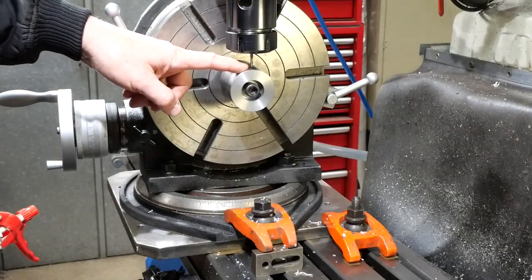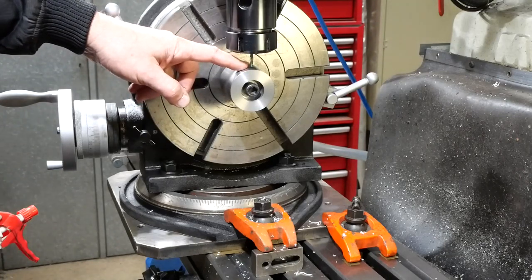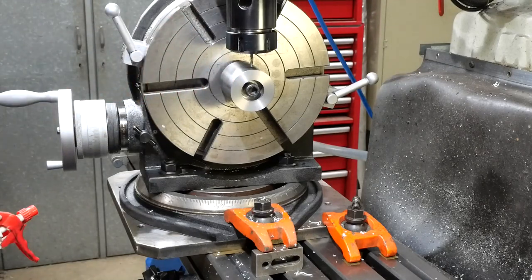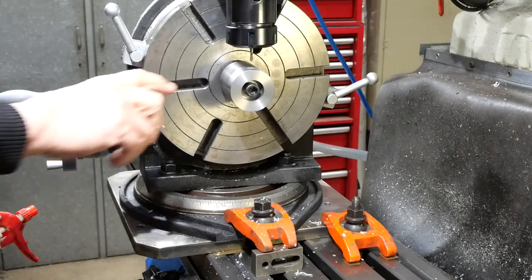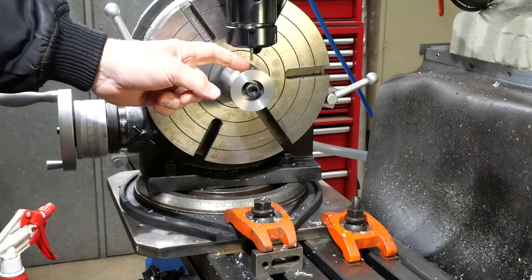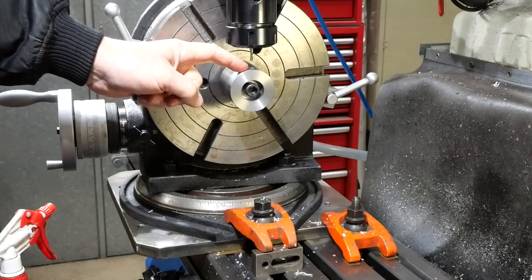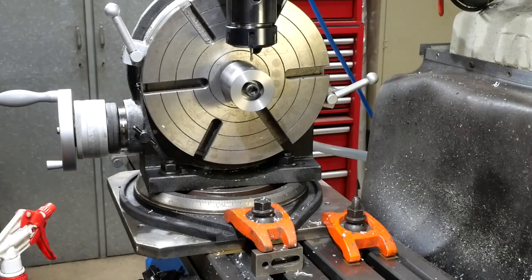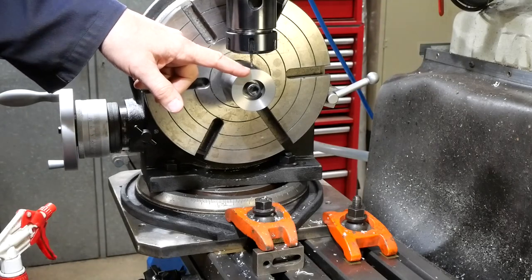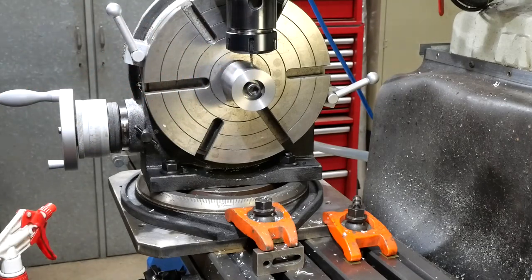So I'm on station and ready now to do my first index hole. I'll be using a 3.5mm flat bottom slot drill for this, and also use the same end mill to clean the pocket out. So, fingers crossed. First hole. So I now have to reposition in a bit on the X and on the Y to leave three quarters of the hole, I guess. So I'm going to come in 2 millimeters in each direction. So I'm going to take the pocket out in two passes, at 2.5 and then its final depth 4.7, and let's see how we go.